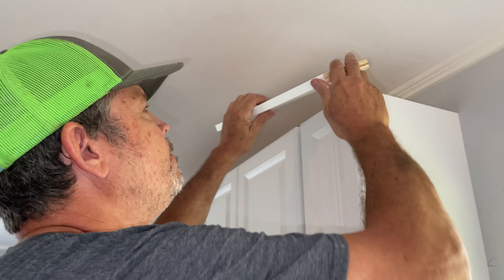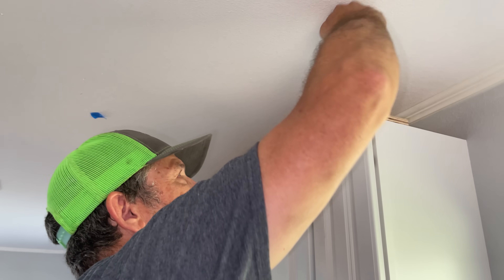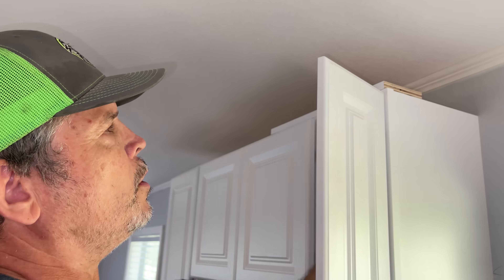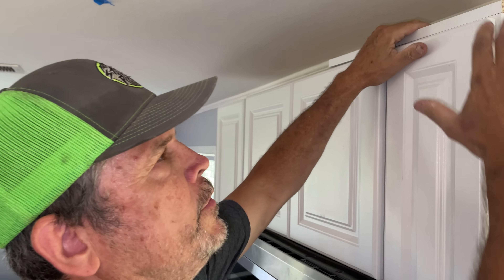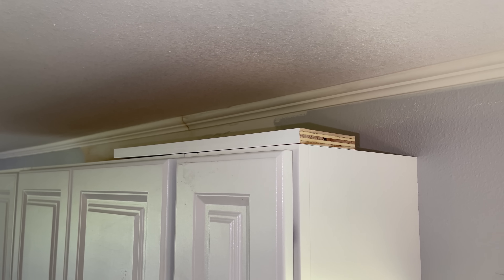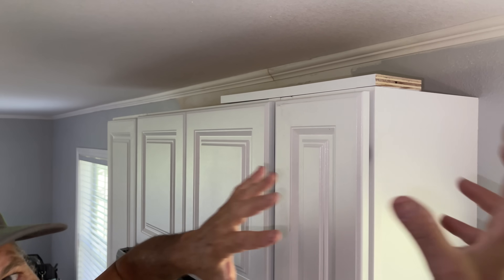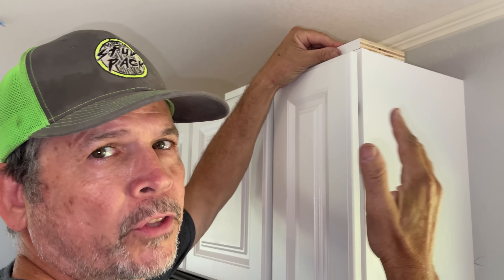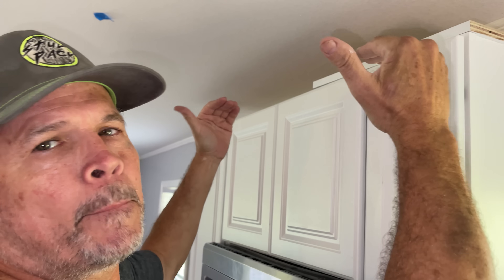So how do you put crown on top of cabinets like that? Use a nailer. Take a separate piece of wood and put it right there. Now obviously you can't really get a nail gun in here — you just open a door and put a screw from the inside. So you've got your nailer on top of your cabinets, your crown pre-assembled, and you get your buddy to help put it up here. But without that little notch to register the crown against, you're going to battle getting that reveal perfect.